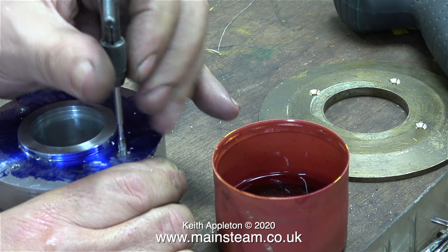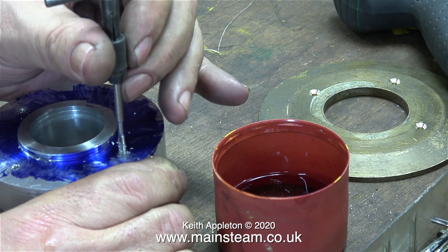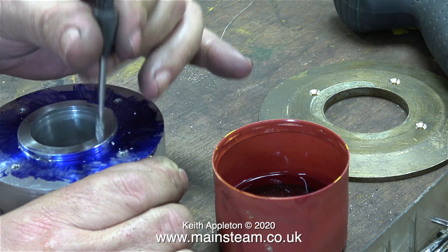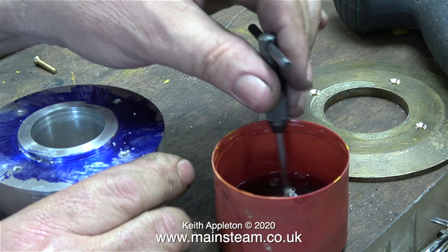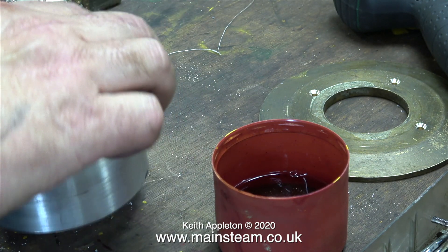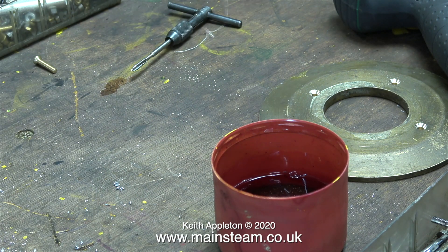I tried to demolish the broken tap with a centre punch but ended up having to enlarge the hole by drilling quite a few small holes all the way around where the tap was. The tap finally came out but it was a right mess — far too big. So I drilled out the hole to tapping size for 0 BA, then made a cast iron plug which I threaded with a die to 0 BA as well. I used Loctite 601, put some in the hole, and screwed in the cast iron plug. I removed the excess by filing followed by emery cloth, then remarked it out, redrilled, and tapped it without event — an invisible, successful repair.